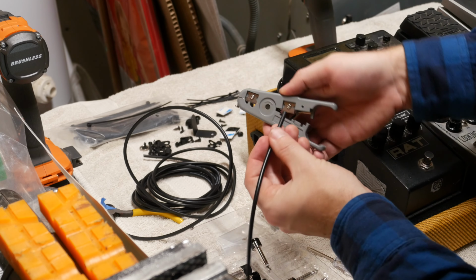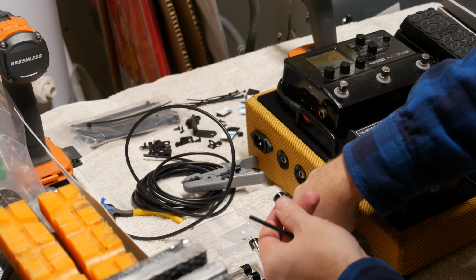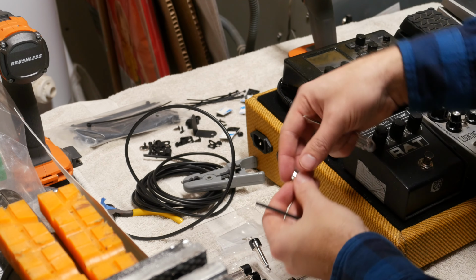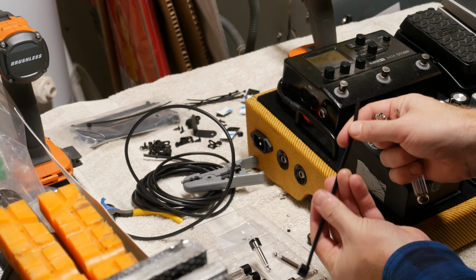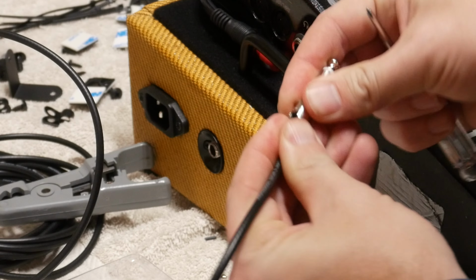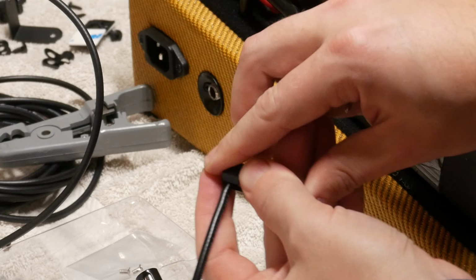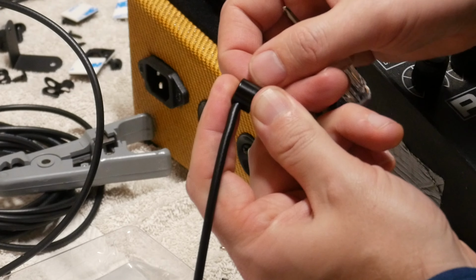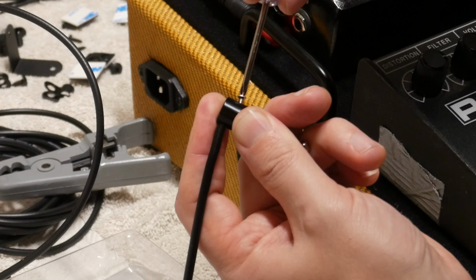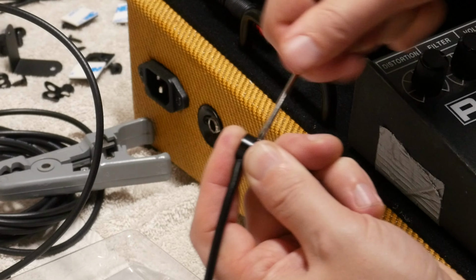I've already cut this side, but just for the sake of demonstration, get a real nice 90-degree cut. I'm going to take off barely anything. Looks good. Make sure that's nice and straight. The ends come with their screw already in it. Take that out. Same exact operation. I'm going to try to make them the same orientation, or at least, in this case, it can be whatever orientation you need. Just keep that straight. Push this end in. Feel it stop. Bend it over. Cap on. Excellent. The cap does have a little bit of resistance because it's just the bent cable. And all we have to do is guide that screw in here and use the provided screwdriver. Not saying it's not a little finicky. It's definitely a little finicky, but really easy. Plus, you get used to dealing with the screw and the screwdriver.